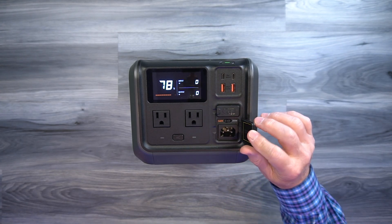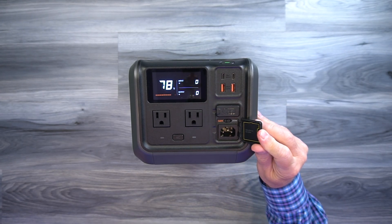Now it's got a lot of special features I'll explain next. When looking at a portable power station, you want to make sure it's easy to charge. What DJI did with this unit is they built the charging circuit — required to convert AC from your home into DC — internally into the unit. A lot of other portable power stations use an external brick for that conversion and can take hours to fill up. With this one, you can plug it into a wall outlet and within 70 minutes the unit is fully charged.